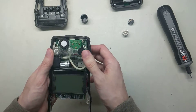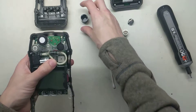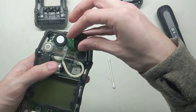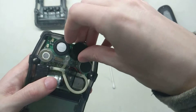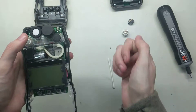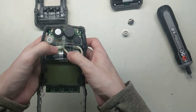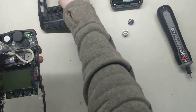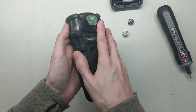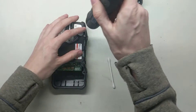Now we've got our sensors installed. We didn't need to replace the CO/H2S or LEL, but we replaced the O2. I'm going to reinstall the dummy sensor — it just kind of sits in the prongs, it doesn't fully plug in. Then this hose will come out — just pop that back in there and make sure it's nice and snug so it doesn't wander around on you. Then we're just going to fold the clamshell back together and put the screws back in.